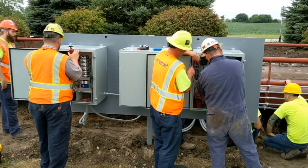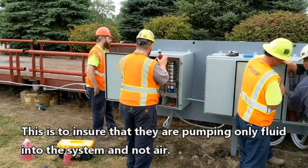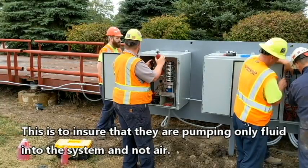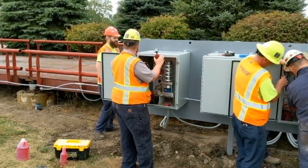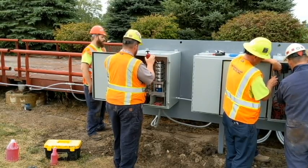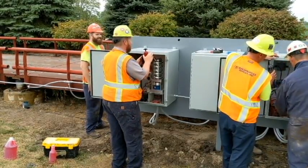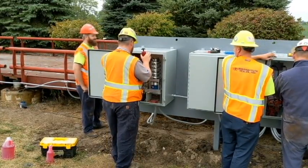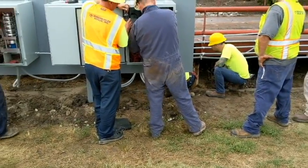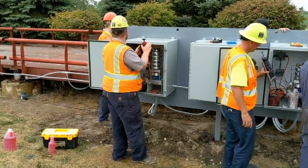The middle box for the drive axles — we have done nothing with that yet. But right here where Chris is at, we have bled all of those lines. That's the trailer axle box. We've bled all the lines going out to the load cells, connected the lines to the load cells, and bled the totalizer out. What they are doing right now is setting the gaps on the load cells at around 30 thousandths. Chris is pumping fluid down; Ron is tucked back in there with Tony and Lance, gapping that load cell.